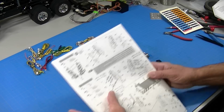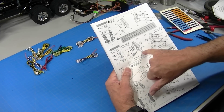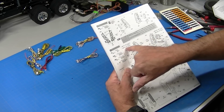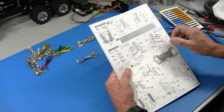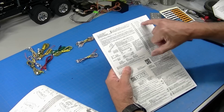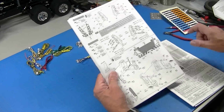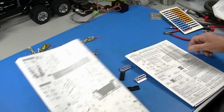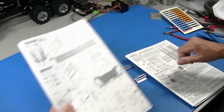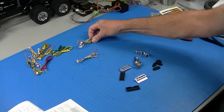But what they want is here we're looking at J17, J22, J13, and J17. Okay, so you go, okay, what are those? Now, you go to the MFC instructions, and here's the numbers. So we'll take this one first. J17, actually it's J14 for the MFC-03. J14 for the MFC-03. We go here to J14, it's white, white, black.